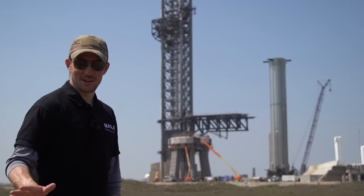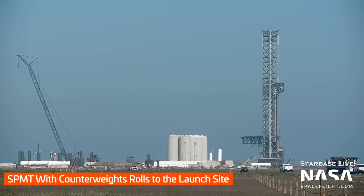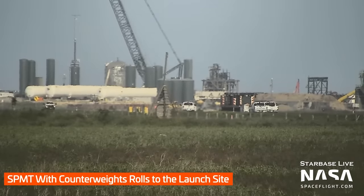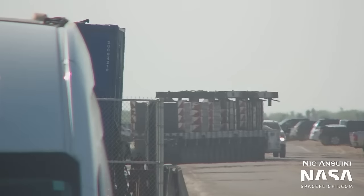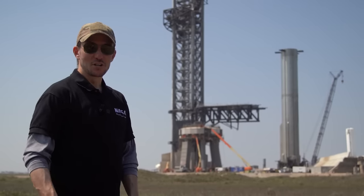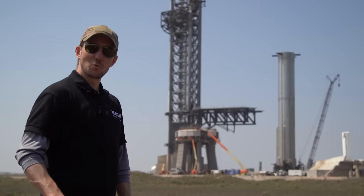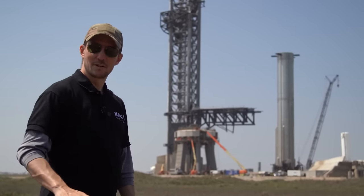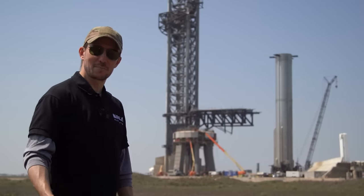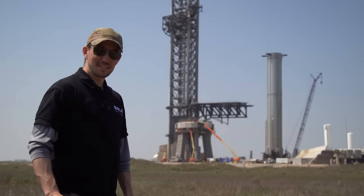So like we mentioned, SPMTs caused a big fuss in the stream chat this week. Normally SPMTs go everywhere — it's not a big deal for them to roll willy-nilly all over Starbase. But this time they rolled up next to Booster 7, and they were stacked with tons of counterweights — literally tons. Why do they need counterweights? When you want to move a booster, you want the center of mass to be low. The booster is really tall and has a lot of weight. The SPMT is pretty beefy, but you want that whole system to have a stable, low-to-the-ground center of mass. So you put a lot of extra weight on the SPMT so that when you put the booster on top, the center of mass is low. With the SPMTs parked next to the booster with counterweights, it was clear it was going to roll somewhere — the question was how far.